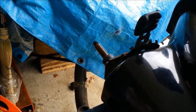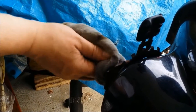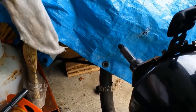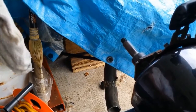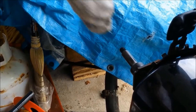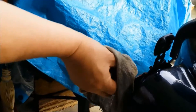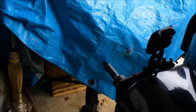I'm just going to wipe it over one more time. Penetrating oil is great for cleaning, but it's not the world's greatest permanent long-term solution. So I'm going to put a little bit of lithium grease — or actually, I think I'll use a silicone lube, so that it doesn't attract the dirt, because this is in a dirty environment. I'll spray it with some lube and put it back together and we'll see how the wheel turns.